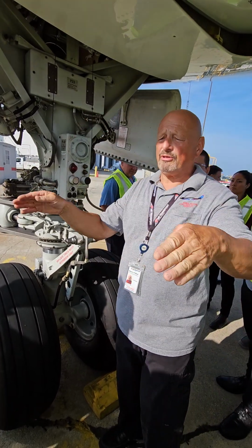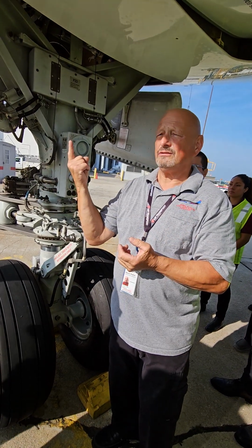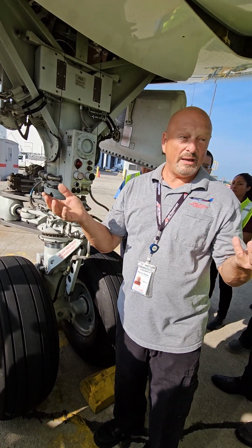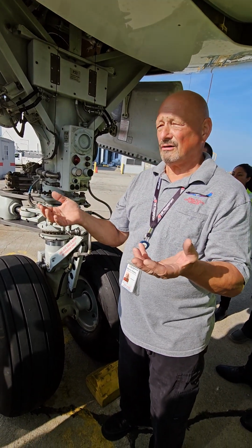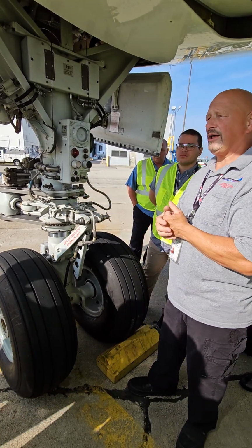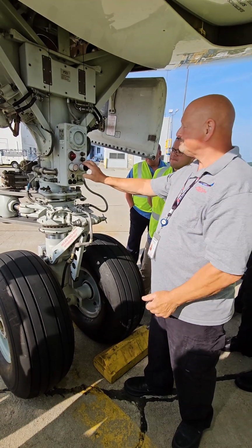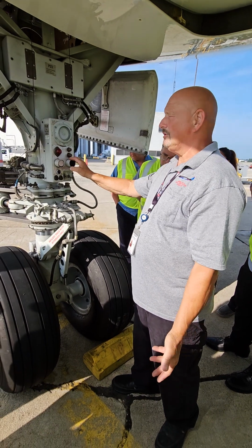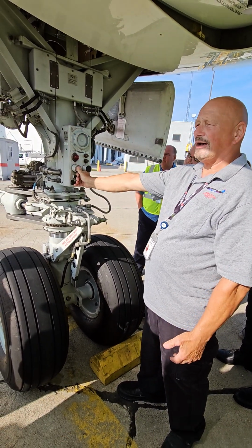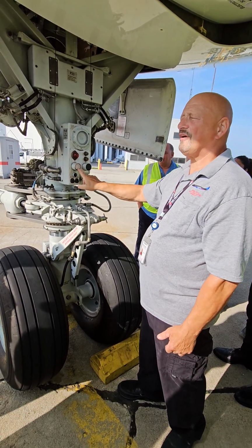Well, you guys remember the fire triangle? What does it take to have a fire? You have to have heat, oxygen and fuel, right? If the APU shuts down, that may be the end of the source of the heat, and the fire may go away. But if it persists, then the fire bottle has to be fired. You can do it from here or the flight deck, obviously. So if maintenance is around, they hear the horn, they know to come down and push shutdown, even though it probably already has shut down, but it arms the fire bottle.